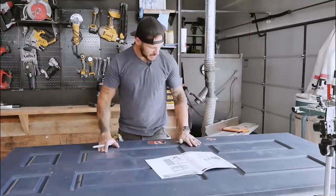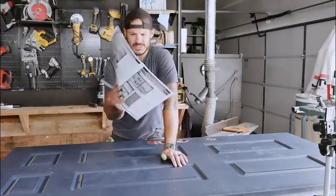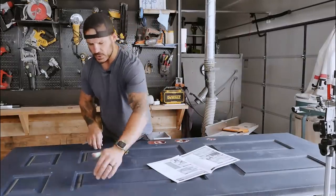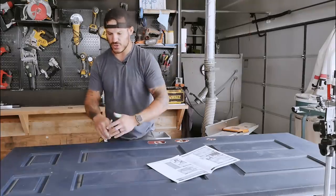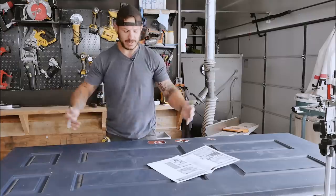All right, so we have everything stripped here. Nothing's gonna interfere with the cutting. Based on the instructions, and to be honest with you, pretty easy to follow instructions, the inner dimensions are 23, and you have a variance of like 3/8 of an inch width, and then height is 65. Again, 65 and 3/8 is your variance.